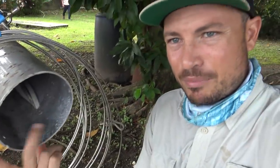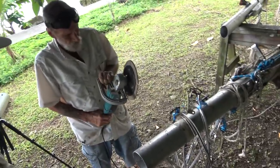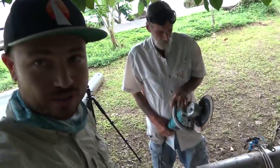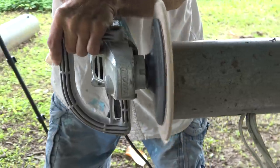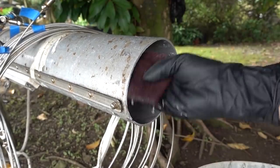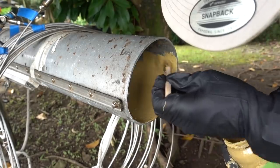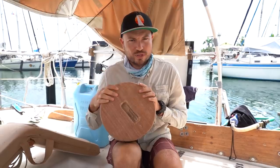Worth here is going to help me out. He's got one of those big variable-speed grinders — a big-diameter one — and he's going to flatten out the bases, the bottoms of the extrusion, so that it's going to mate with the heel well. Thanks, Worth, I really appreciate it. The next step is to move forward with our mast bases. There are a couple of concerns with these wood mast bases — this wood is super strong, super dense, super heavy, but even really strong heavy wood is susceptible to rot.